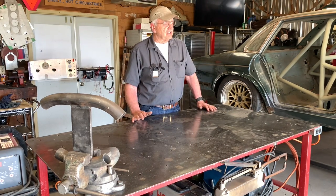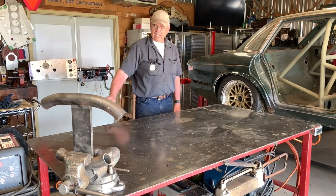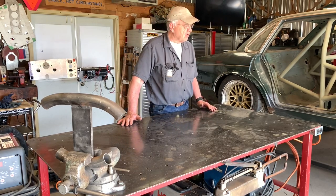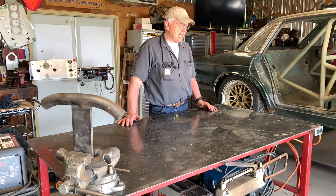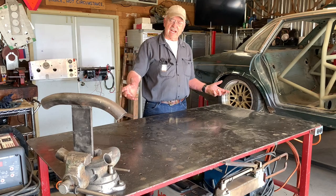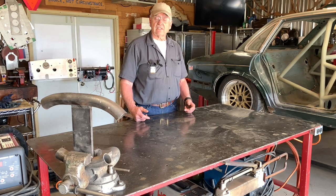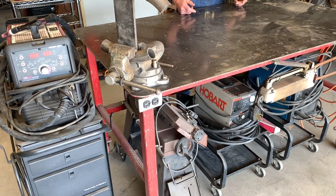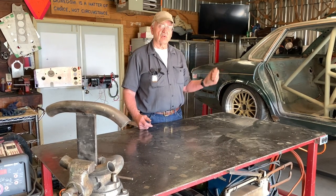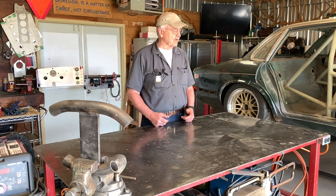The rest of the bench is made out of material I had on hand. The square stock in the corners, on the sides, and on the cross piece in the back is 11 gauge, two-and-a-quarter square mild steel tubing — I just happened to have it. On the two sides I've got some round pieces because I was out of square stock, left over from a track car roll cage project. It turned out to be convenient to use those to store C-clamps and other clamps, and that worked well for quite some time.